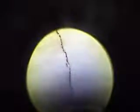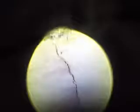There's a 1/8 inch wide crack running from this joint to the next joint. It's about 8 inches of sediment buildup in this location. Once again, we have a crack at the 12 o'clock position, about 3/16 inch wide, running from joint to joint. Here you can see the sediment.